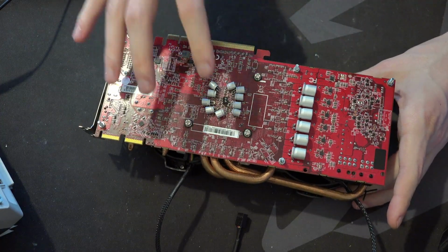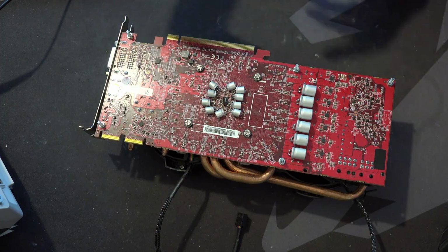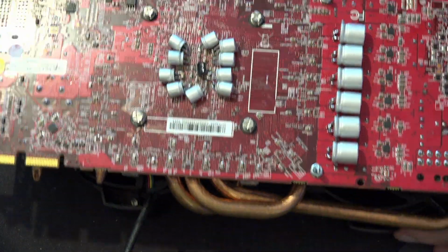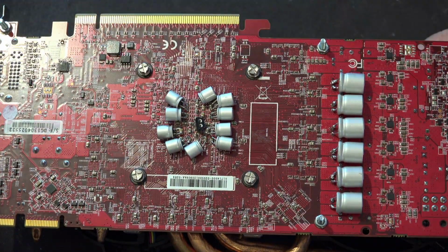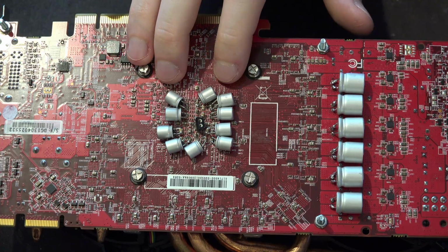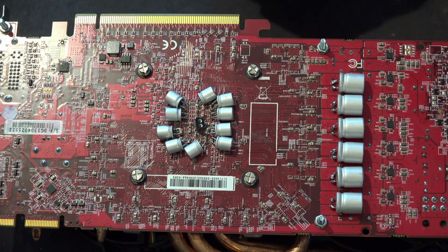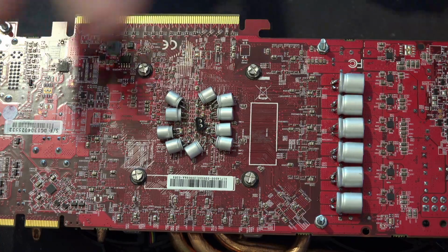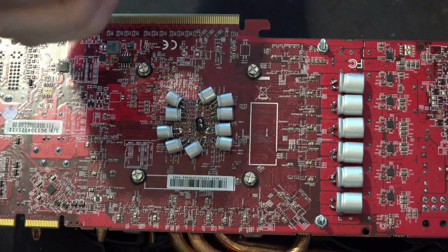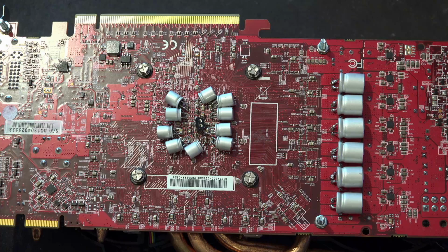Some of them are not attached in what I would consider a good way. All of them are currently a massive structural integrity hazard because, if we zoom in on that, they're just soldered onto multi-layer ceramics. And the thing about soldering really anything like this to a multi-layer ceramic capacitor is that multi-layer ceramic capacitors are not structurally robust. So if you hit these caps with something from the side, it will probably shear off bits and pieces of that multi-layer ceramic, which sucks.